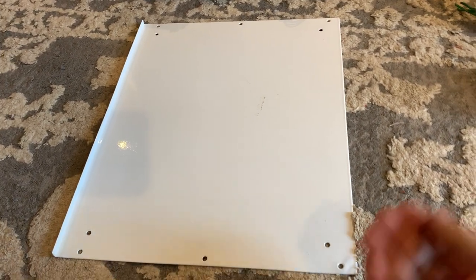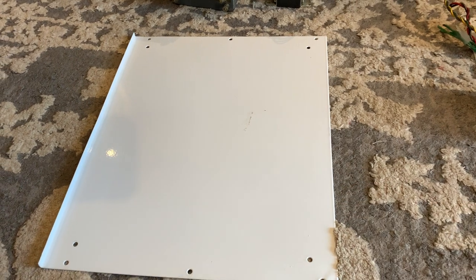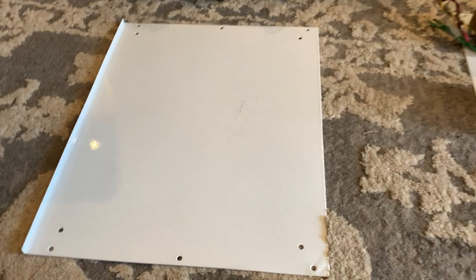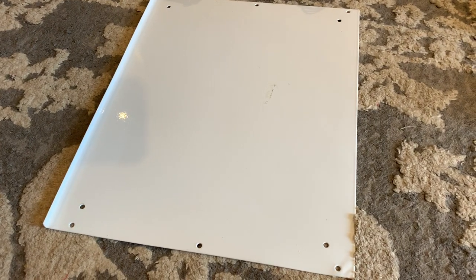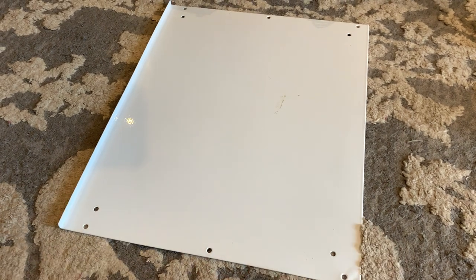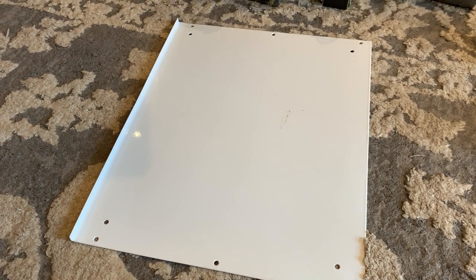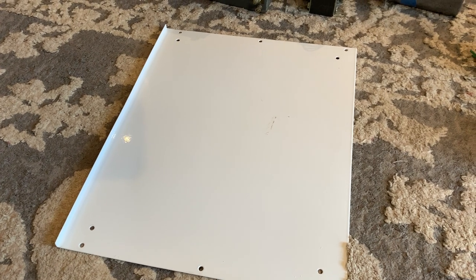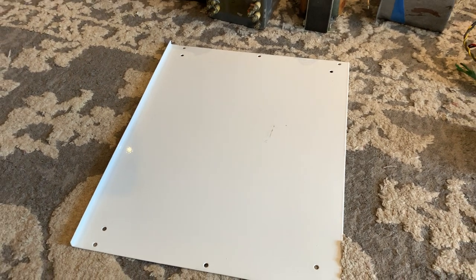What you will do is mount all your parts onto this plate. Some of the parts will be on top and some of them will be underneath — and most of them will be under the chassis. The only things you want to put on top of the chassis are: the vacuum tubes themselves, because they generate heat and you don't want the heat to get stuck inside the unit, and those transformers which are potted or have end bells.